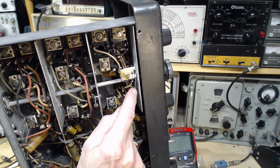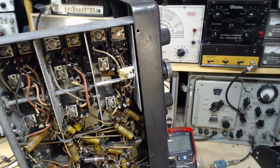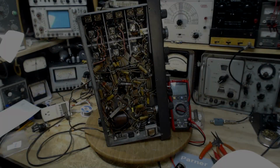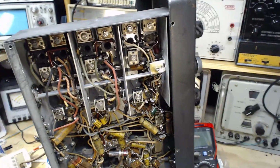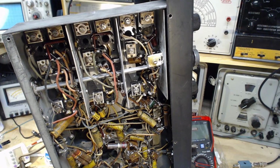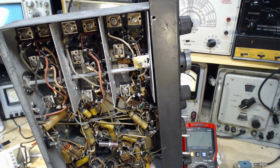Goes straight from here to a switch. So the capacitor goes to the coil and switch. And there's this guy sitting here too. Okay, I'm going to study that schematic until I sort this out. Okay, well, I could not sort things out. Which makes me aware that maybe the schematic, even the one that shows the 5Y3, may not match this radio perfectly. So I've just gone ahead and replaced it with a 0.01 and used this style of capacitor there.